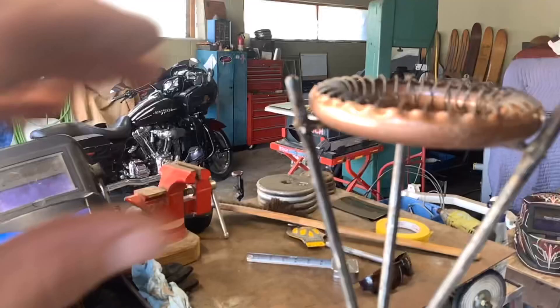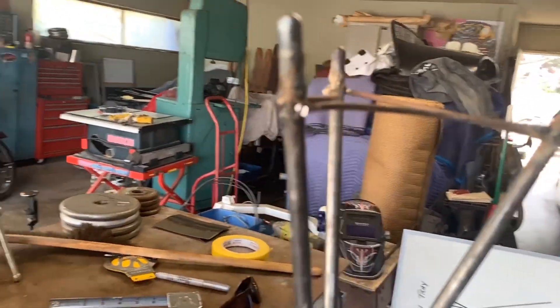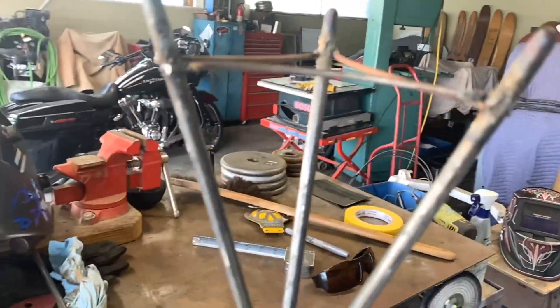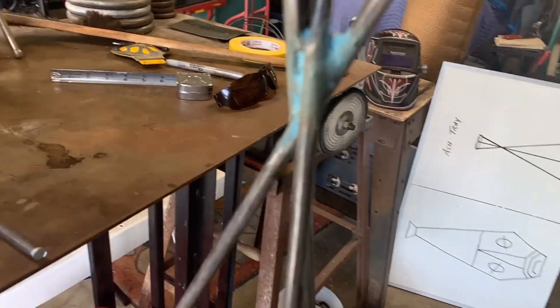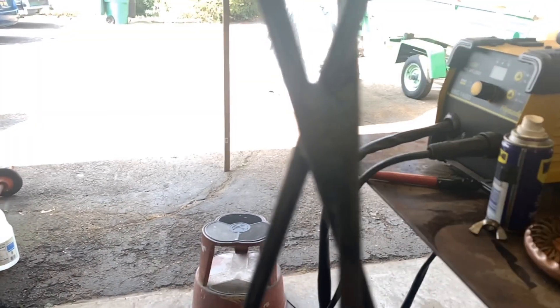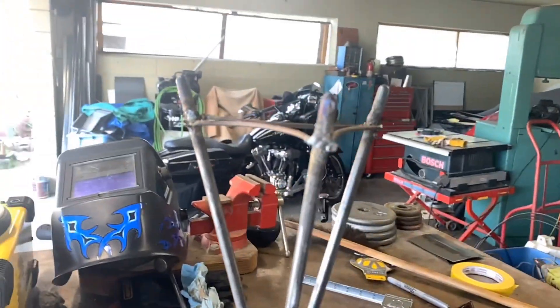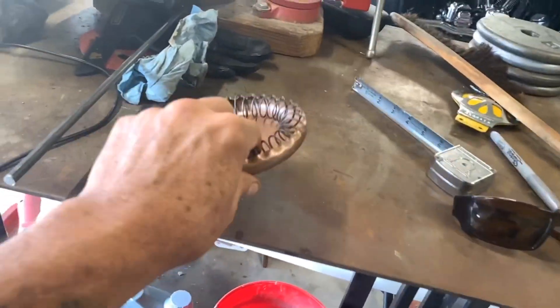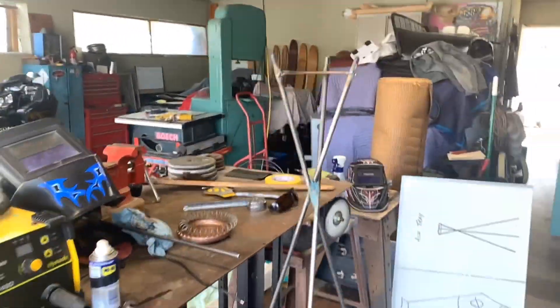There's our perfect curve. So what we're doing now — I got these three little pieces in these little triangles and I just got to sand and clean all this up really nice so that when I paint it black it looks really good. We're going to sand all the little welds and dress them up real nice. And down here — if you're wondering what this blue is — I had to put a little bit of body filler in because the way the angle was, it was hard to fill it with weld. So we're going to sand that real nice, get it smooth, and our ashtray sits right on top like that. Now this got pretty scratched up so we're going to repaint this, clean up the spring real good, and then paint everything black. I think the project will be finished.